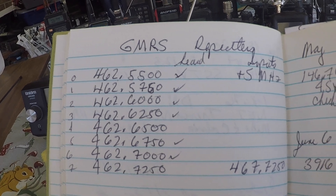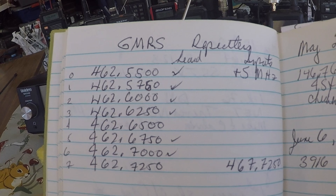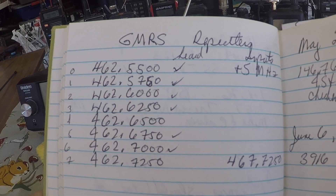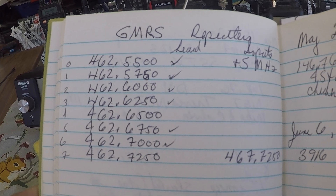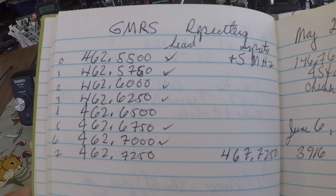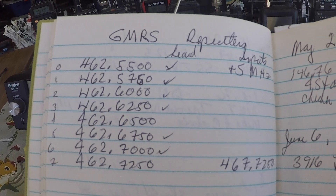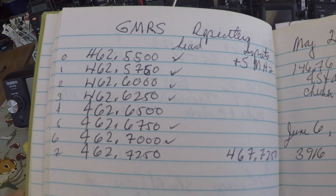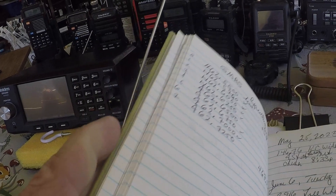Good morning ladies and gentlemen. Today we're going to take a look at some of those Baofeng Chinese radios. They're about $25 a piece when you buy them two or three at a time, which we did around here. What I did with one was I took GMRS repeater frequencies, put them in, put it in scan mode on the channels, and marked off what I heard. Then I knew what channels I could concentrate on, and it gives me a good first cut for having a really cheap scanner. That's what that $25 Baofeng radio is really good at.